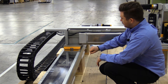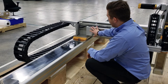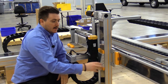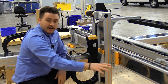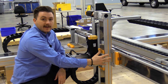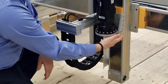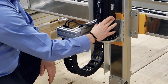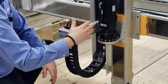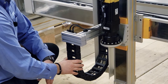We can also do other configurations depending on your application requirements — side mounted, horizontally mounted, or even both side mounted. Here we have the HMRB 18 side mounted on our X and X prime, and off of the HMRB 18 we have the HMRB 11 mounted straight to the axis. On this gantry system we've customized a bracket to hold our Stober gearbox and mount our motor to provide our customer with the theta axis. We've also included a bracket to hold our cable management system for the brake and encoder feedback cables to the motor.